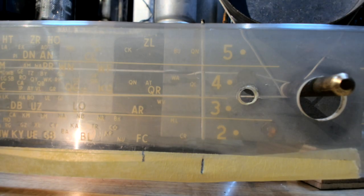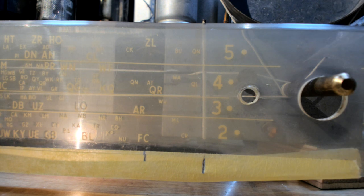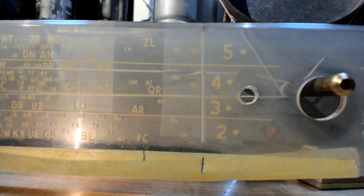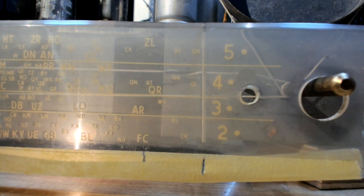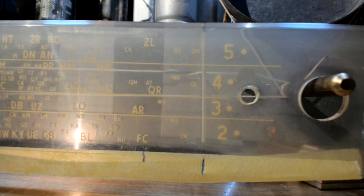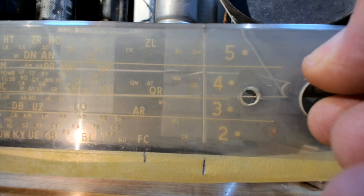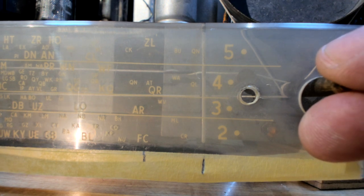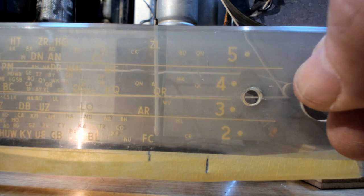Okay. Alright, just going to check the RF alignment. Just running the radio yesterday, it actually looked pretty good. I've hung the scale on the front, just on the two knobs. I can just move the pointer along a bit if this is out, once I get the real scale in the case. So that won't be an issue. The scale comes off the front, you just move the pointer around, I think. Now there's a mark there, and that's the mark. I've got the tuning capacitor fully closed, and it's supposed to line up with that little mark there. I've got my generator on 600, so I'll just turn up the volume, and we should be.